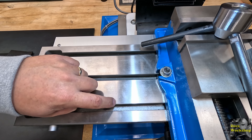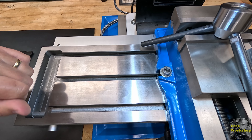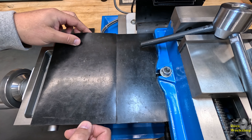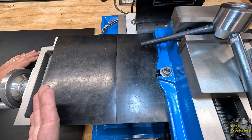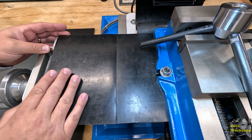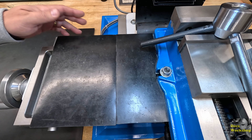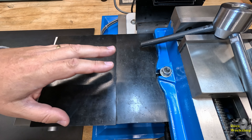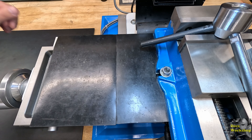This faint rust line — I'm going to probably use a little Scotch-Brite to get that off. What I want to do is cut a full piece of neoprene rubber to actually fit all the way across to the end. That way it keeps that moisture away. I can keep it oiled, but I want to cut a new piece of neoprene rubber to fully eliminate this gap and fully cover this side of my mill table. Let's get out the roll of neoprene and bring you over to the cutting bench.